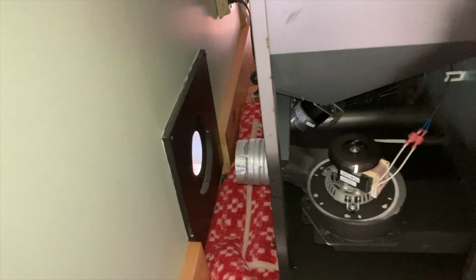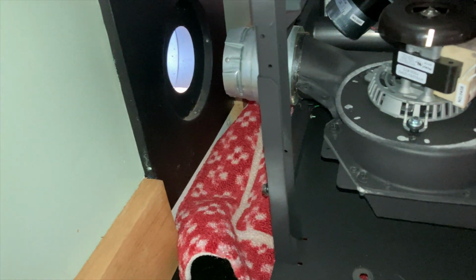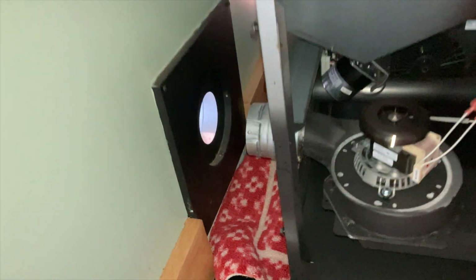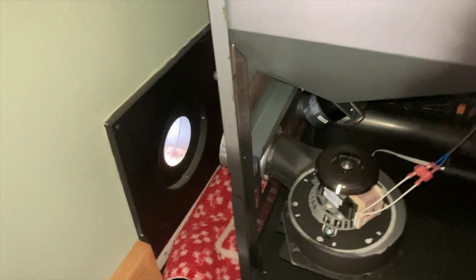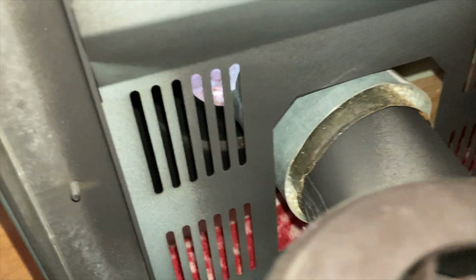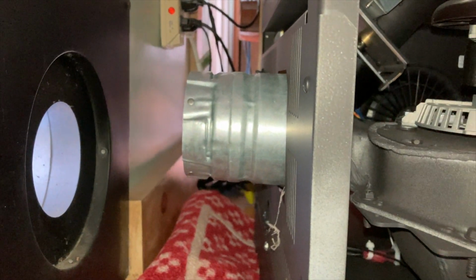If you put it there on the pad, then the exhaust is nowhere near. So we're talking about siding and putting the hole in the correct place. If I move the unit over so it's lined up, it's still too tall. I don't know if you can see from now. It's still too tall. Whoops. So I still have to do stuff with the siding.